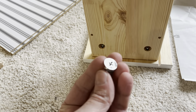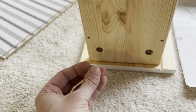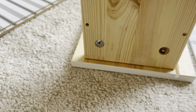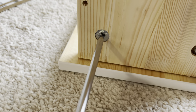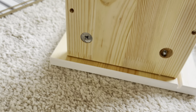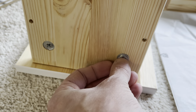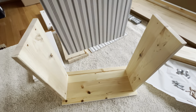Together with all the screws, you're also going to find these round locks. Take one of these and push it into the round hole — they'll only fit in one orientation. Then take a Phillips screwdriver and rotate this lock clockwise until it stops. That keeps the boards in place. We're going to repeat this four times, one lock in each hole.